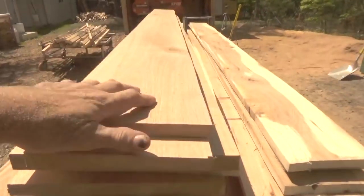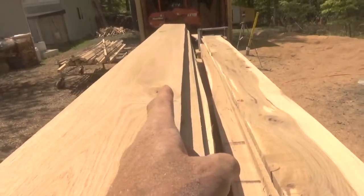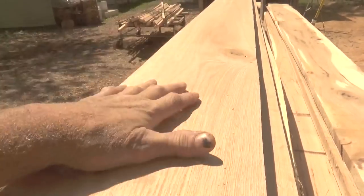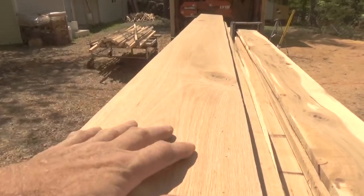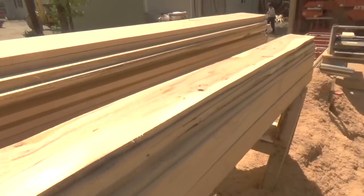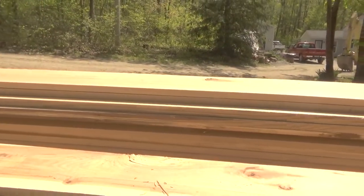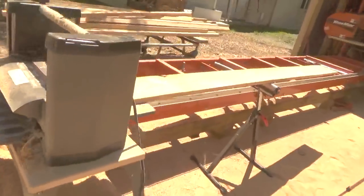All right. The same thing with any board that's 3/4 thick. Doesn't matter if the edge is like this one, a little bit wavy, because that's what jointers are for. But the point is that if it's planed itself all the way down, and it's 3/4 of an inch thick yet, that's specialty pile. If it's less than that, or if it hasn't planed itself and it's still at 3/4 because of cupping or whatever, that's where I make molding out of it. So anyway, back to this board.